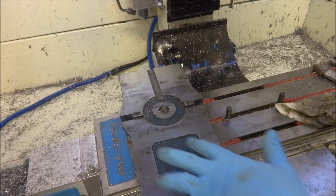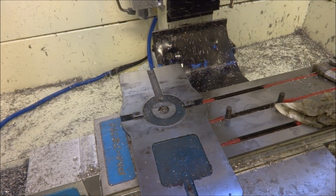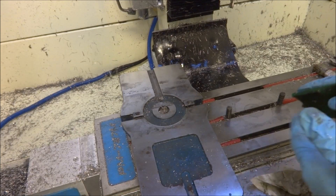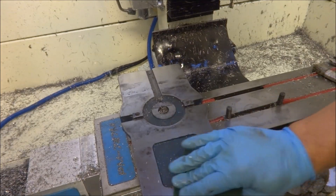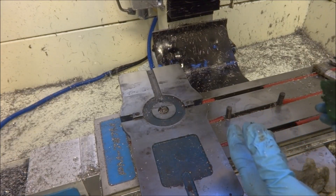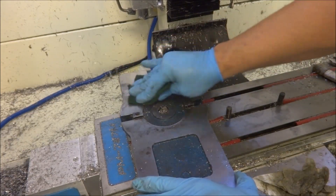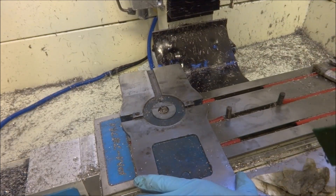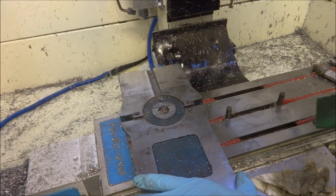I have to say I'm a little disappointed that there was rust under the vise, but I kind of suspected there would be. I haven't seen anybody that's been using flood coolant remove their vise and not have a little bit of corrosion underneath, so I was expecting it. And it is kind of funny that it doesn't do it except where the two metal surfaces contact. I'm not sure what the cure for that is. I will say that before I installed this, I didn't put any kind of lubricant down, any kind of coating — that was probably not very smart on my part.